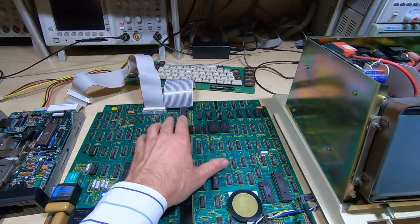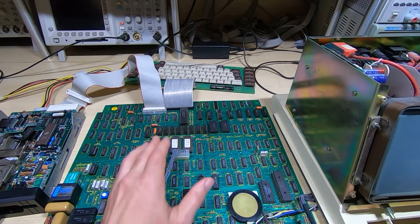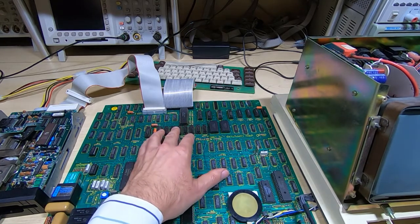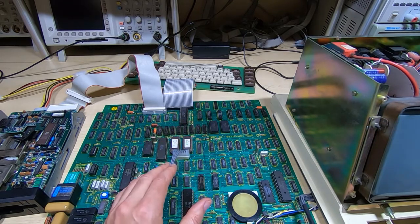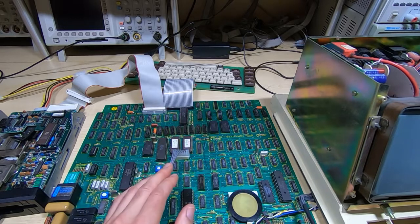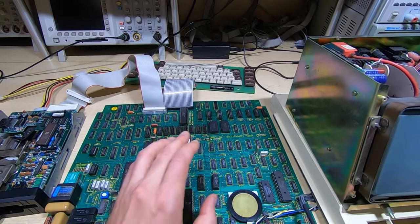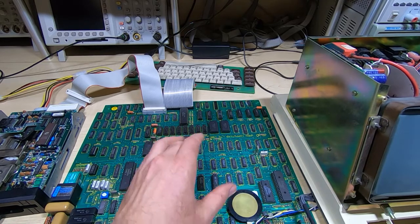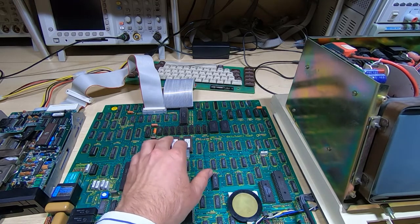So looking at the code, the way the self-test works, which is of course where it was failing, is there are blocks of code, functions that do certain tasks, and one of those is to test a block of memory. It then returns an error in the zero flag of the processor if the test fails, and that's used to flag with the system that the test for that particular memory block failed.